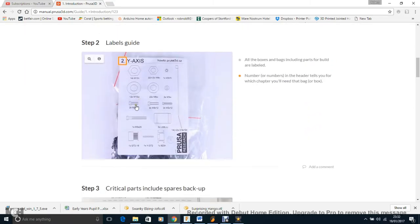Everything's labelled, which is good. But you've got an M3x10 and an M3x12 — only two millimetres difference — and it's easy to mix them up. If you use the wrong one you might not bite the thread and it can cause problems later. I always like to just measure one up: if you need five of a type, measure one and then line up the other five next to it so you know you've got the right ones.